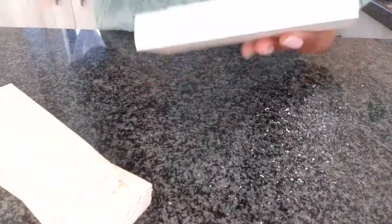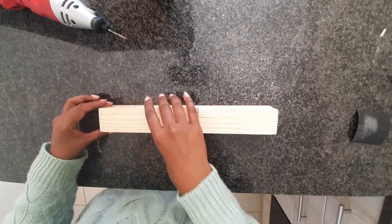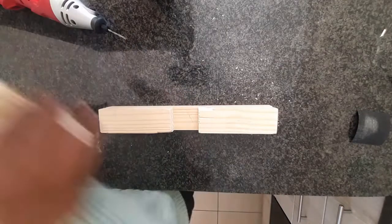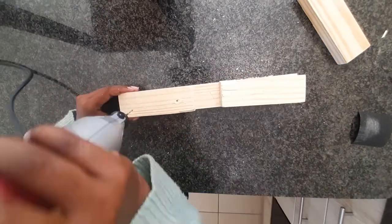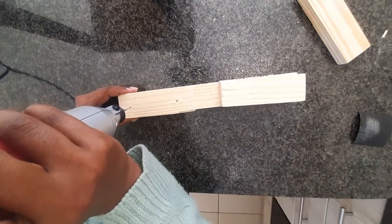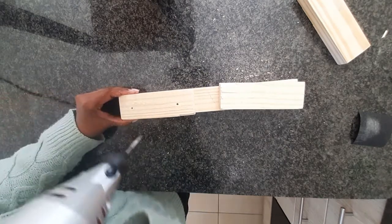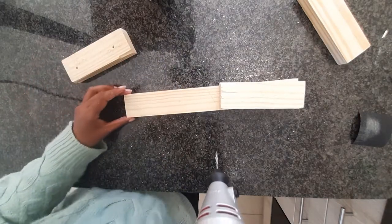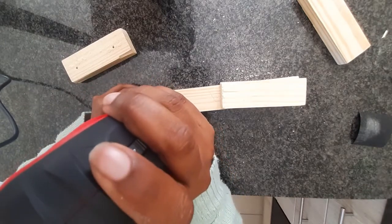After my pieces were cut, I started off with the horizontal pieces and sanded them down really nicely. Then I took the smaller pieces and attached them to the bigger piece using a drill, making pilot holes and screws. When I drilled through both pieces of wood it started to smoke really badly, so I just drilled through one piece until I could see a mark on the other side, then made my pilot holes in the second piece and screwed them together.